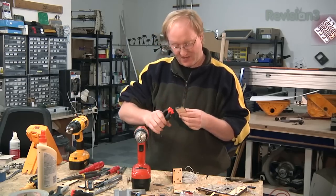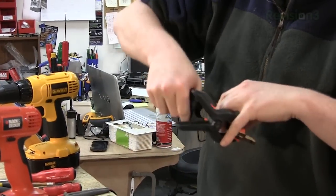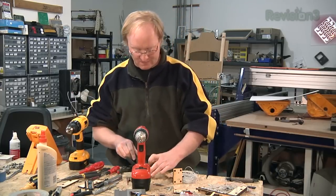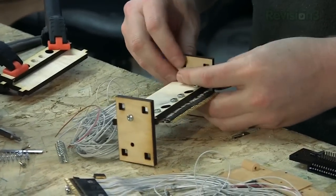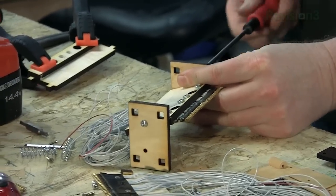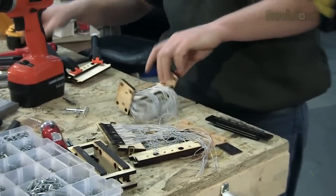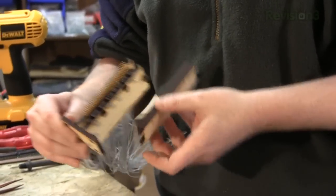What I should have done on this piece was have openings for the screws, but I didn't. Sometimes it's just hard to anticipate things you need in your design until you actually make it. What I usually try to do is make one piece, examine it, then design the next piece. Because if you sit there and design something all day, you might start building it and realize things don't work. So I like to design one part at a time, laser it or print it one at a time, and put it together in steps. That way if you find a problem you'll find it early on. And here's why you make your part symmetrical — so if you want to flip something to the other side, you can.